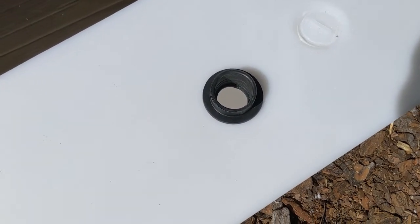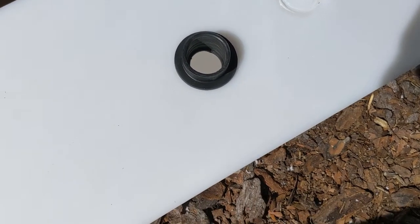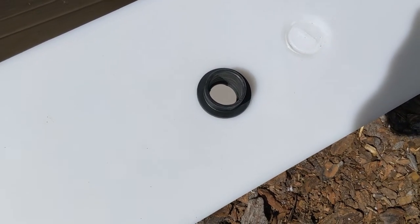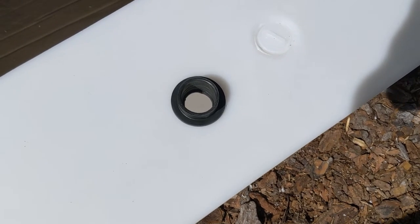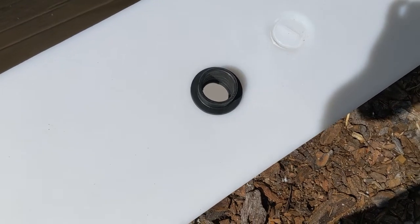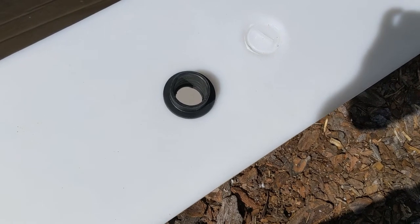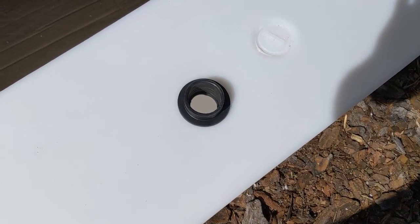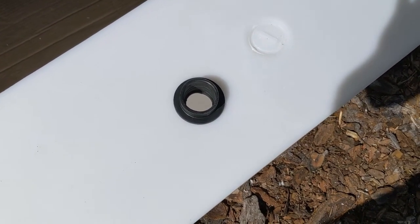But I'm gonna go ahead and fill this with some WD-40 just to make it slick. I'm gonna cut a new piece of pipe to put up in that elbow, that 90 degree. I didn't glue that in because I put paint on it, so I took that out and threw it out. So now I have to test to make sure it really was in the right place before I secure everything. So I'm gonna cut that piece, put WD-40, and then put WD-40 on there as well, so it goes up in there nice and easy.